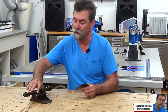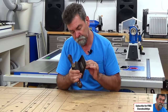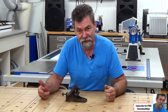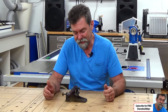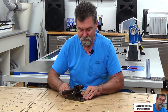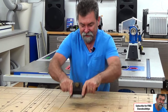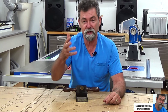Feed it in from the underside into the body and make sure the burr is facing towards the front. Sit the plane like that, push down on the handle, and tighten. The blade is set — how quick is that? Now the matter of where we set the angle: if I were to turn that slowly, hear that? Then pull the back, wind the back one up. Now I can use it. It's never going to lift or chew into the material — it's just going to keep on scraping across the top. There you go.